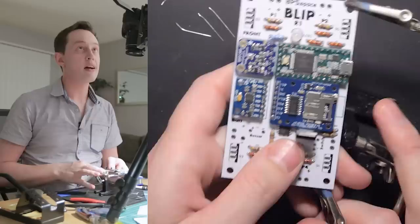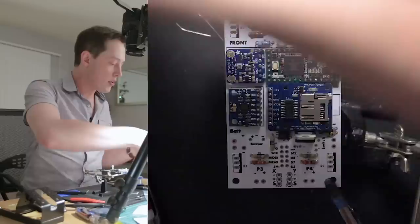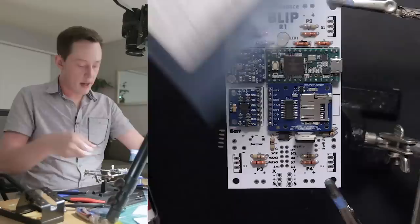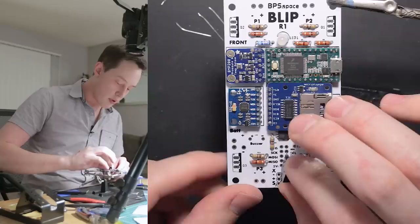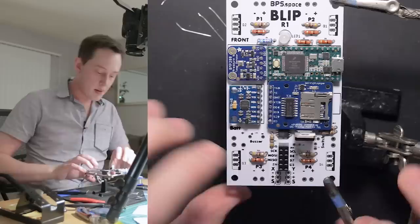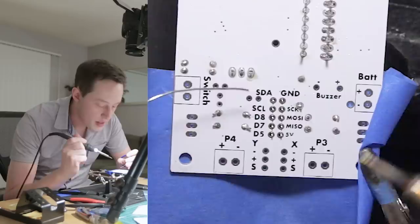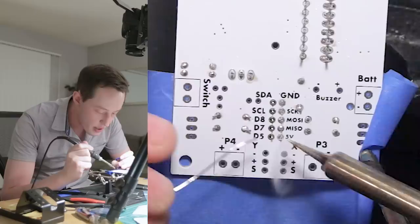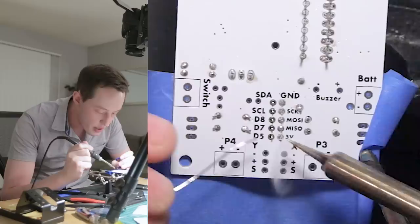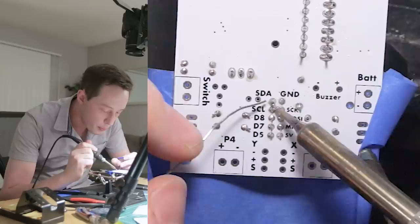Next up, I'd like to tackle the header pins — the little set of pins that go right here on the board. These are sort of the breakout capabilities, so if you're someone building this board and looking to add something to it or change some of the functionality, you can use these header pins to do that. I've grabbed one of these little header pin slots — a regular 2.54 millimeter spacing slot that you would find on any Arduino component or Arduino board. We'll slide that in right here, use some tape on top to hold it while we solder it on, flip the board over, and get soldering. Five pins on each side — they're really easy because the pins that come out of the bottom are very short.